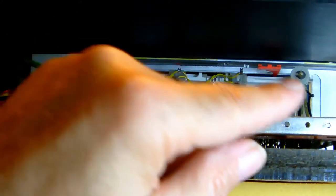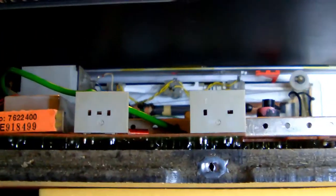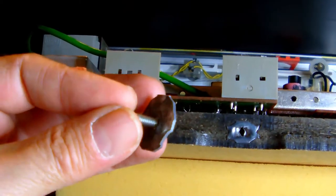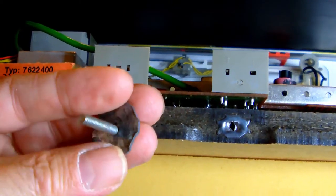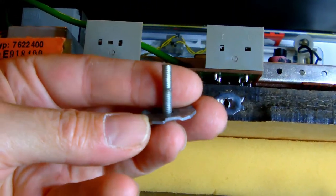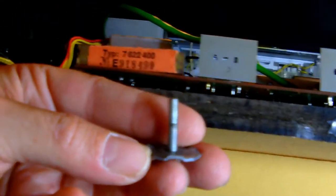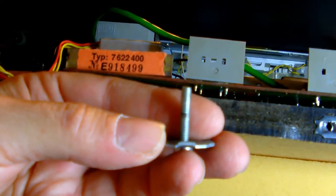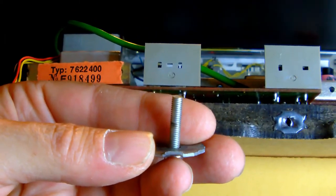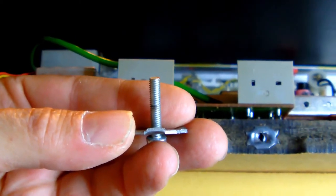And that way you can fit in all the knobs and the meters in one go, so without too much trouble. Also, you need to use the special washers that were supplied, obviously, with the tuner. And you make sure that the teeth point upward, like this, okay? Not the other way around. And so what I do now is to screw in the screws finger tight, so that it's not extremely tightly attached. And that way I can take a final look at the front of the tuner to see whether everything is nicely aligned. If that's the case, then I'll tighten them with a screwdriver.